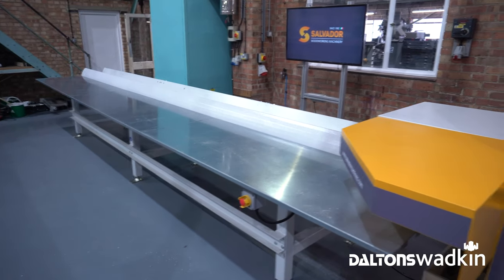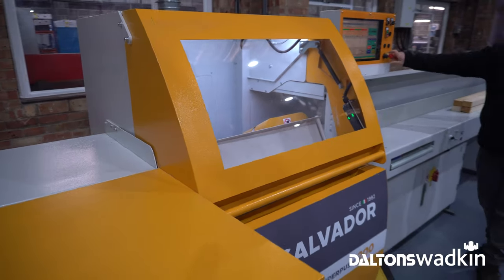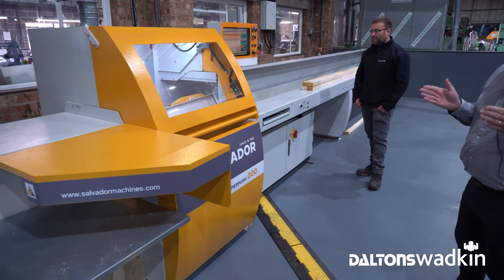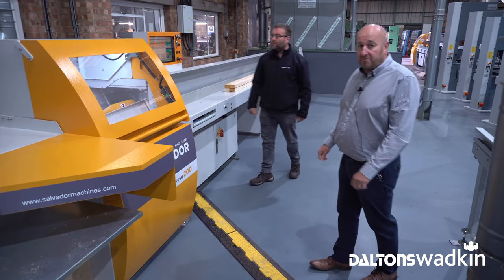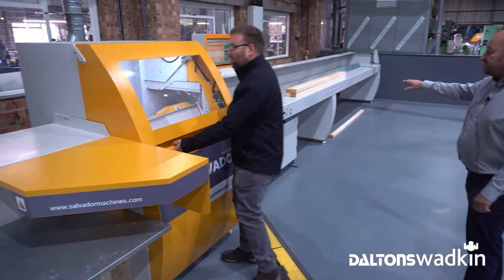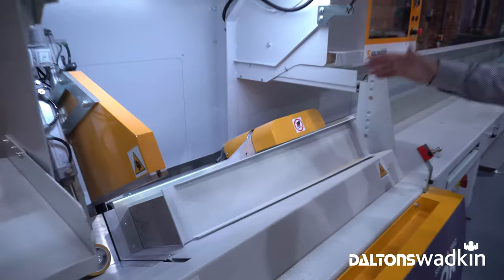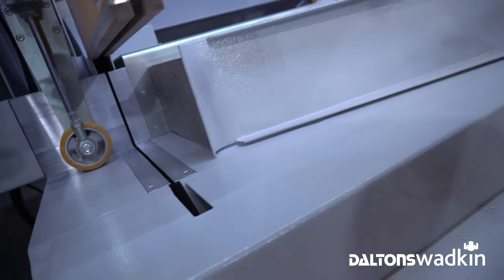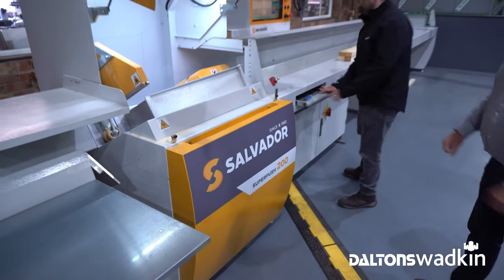The machine has a 550 millimeter diameter blade powered by a 7.5 kilowatt motor, pneumatic upstroke with clamping arrangements to allow perfect control of timber being machined to size, providing a guaranteed 0.5 millimeter measuring piece on piece. It has a gravity preload system, 30 degrees, and inside you have the side aligner clamps, which is here at the infeed, the saw pressure shoe, and the outfeed top aligner. There is an option to have a side packet aligner for multiple piece cutting. We can discuss that in the next video.